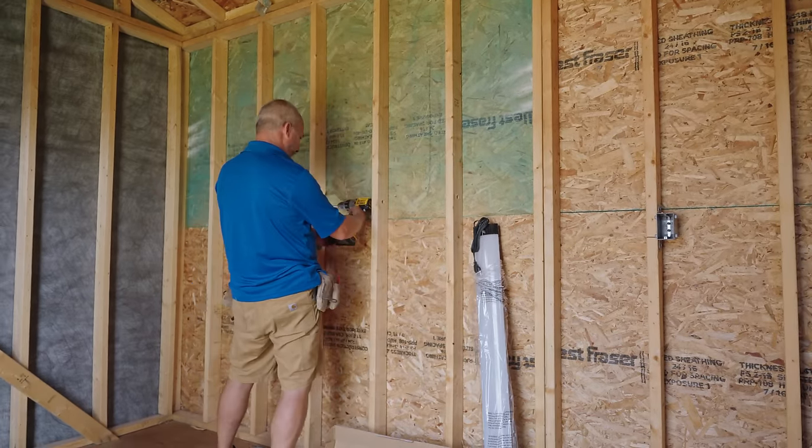Now, it's not just enough to have it get to the hole, okay? We want to make sure it gets to the hole and it's out of the way. If anybody else ever comes along and wants to insulate this, turn it into a tiny house, you don't want to have your wire on an angle to the hole here. Try to have it go up and around, okay? Don't need a staple at the hole. A hole is considered a place where the wire is fastened. Remember, the staples aren't here to hold the wire from moving around. It's to keep the wire from getting in the way of any finishing work. So that's why we have staples. That's why we have code up here.